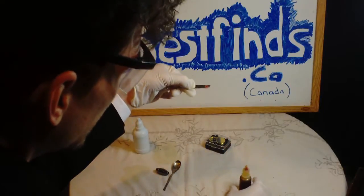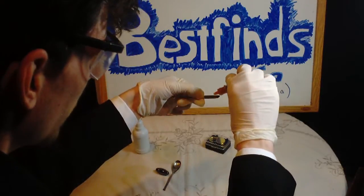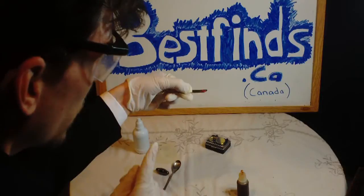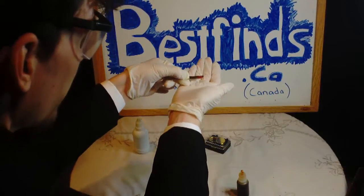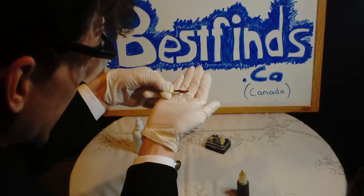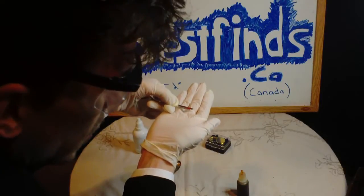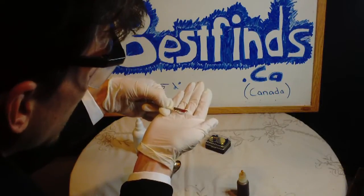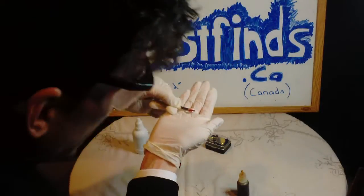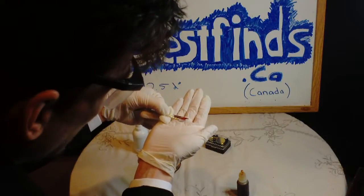There is silver in here. You can see it's red initially. So it turns blood red initially. And as it digs into the metal — because that's what acid does — it will actually turn a darker color, telling us that it's not pure. And in fact, if we cut into this, we'd get an even better indication. But I can tell just by letting it sit there. And this will ruin the piece, by the way.